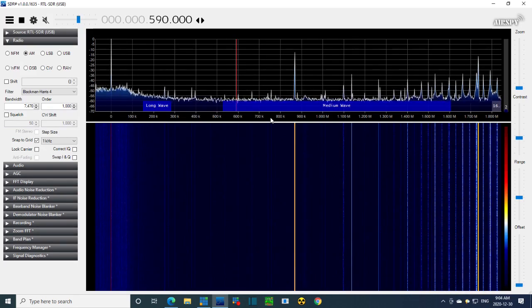270 kilohertz. So what happens if I hit this radio with 270 kilohertz? Does it race right through the IF? That's worth a try. It's definitely worth a try. So I'm just going to leave it looking at the SDR. I'm going to change the frequency here down to around 270. Oh, wrong control. Around 270. Oh, we're right on 270 right now. So I'm going to vary the signal generator.